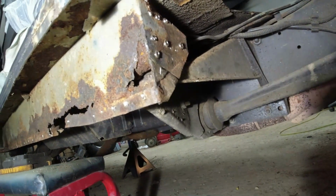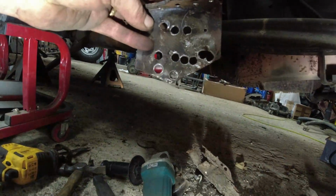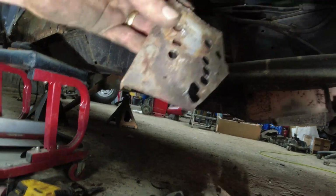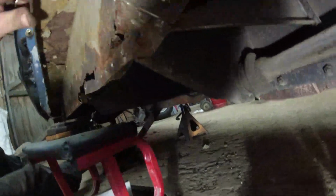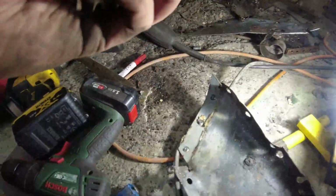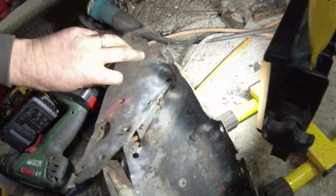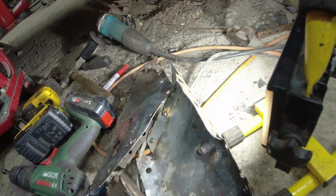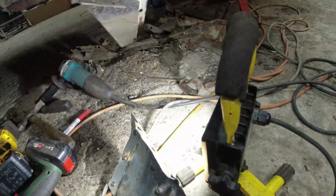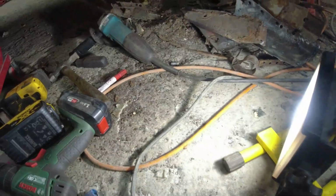Yeah, it's quite a bit of work getting that lot off there. Where is it? And all those spot welds, and it still was rusty behind. Silly arse. Right. And then for the floor, I've got the floor section, I've got the floor support that went there. Then I've got the section of floor I chopped out, which is that piece there. And I've got the closing panel as well. There's quite a few bits. I mean, most of this car seems to be on the floor now, it would seem. It's not the case. The bits that I've cut off, really, are to save time.